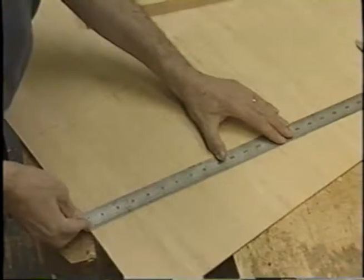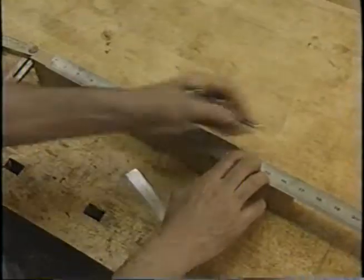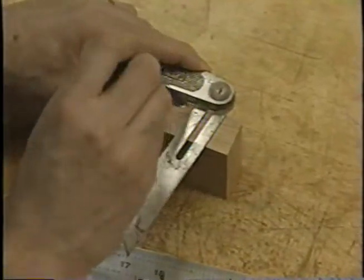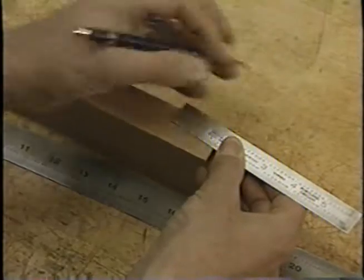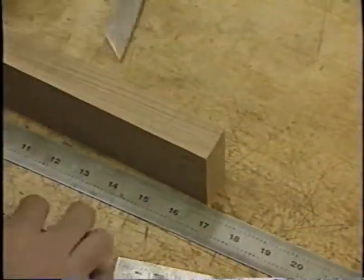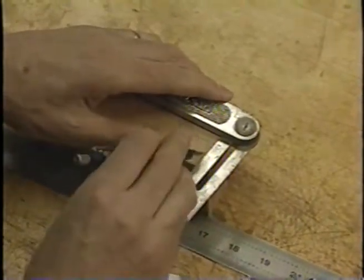To get the rail's shoulder to shoulder length, measure the drawing and lay off that distance along the edge of the rail. Mark the shoulder, measure the depth of the rear leg mortise, and mark this off perpendicular to the shoulder. Eyeballing these perpendiculars is quite accurate enough. Then, mark the tenon end and trim off with the same bevel angle as before.